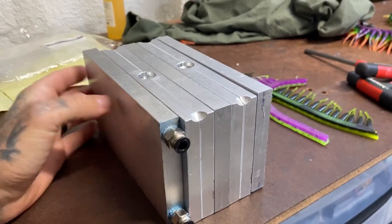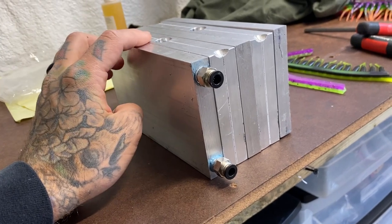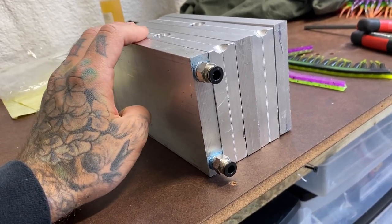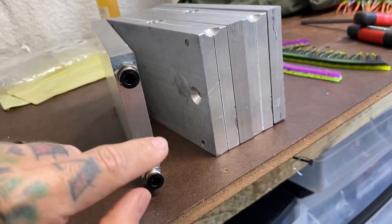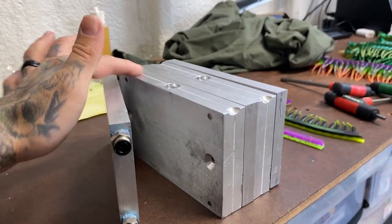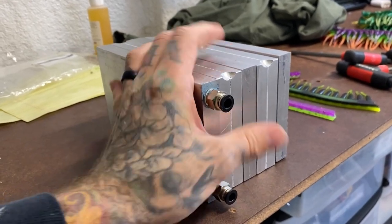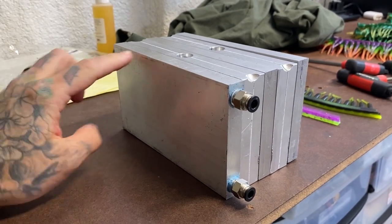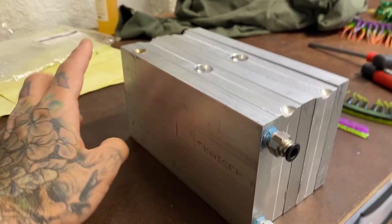I'm going to show you guys how to do this. You can go down to your local steel shop and ask them for some aluminum stock 6061 — I got this in five-eighths of an inch thick. I have the dimensions of my molds: these molds are seven inches long by four inches tall. They'll cut them to the right size. Once you get them, you're going to have to make a hole that goes right here to connect the two channels together.